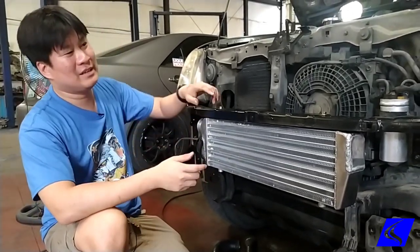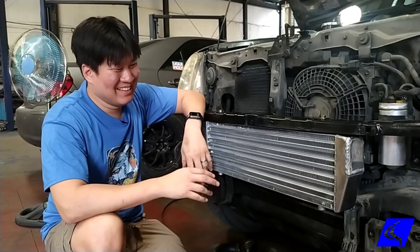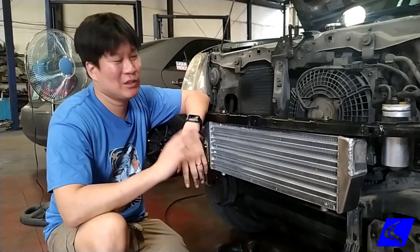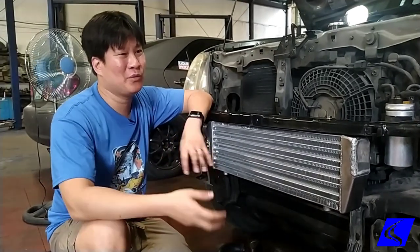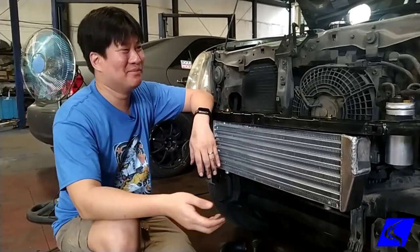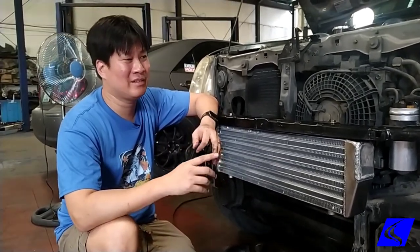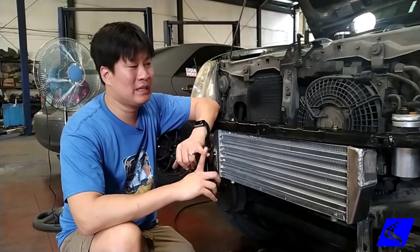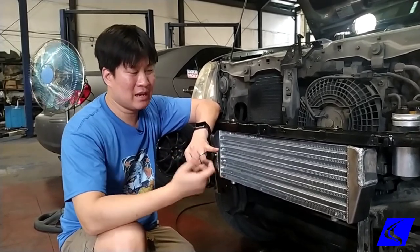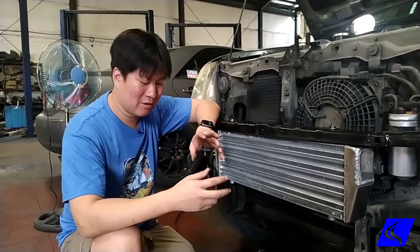As for the question of whether aluminum is better than stainless — which is hotter? Neither. The temperature inside the engine bay, let's say around 70 degrees — it's 70 degrees whether it's aluminum or stainless. So one is not better than the other when it comes to heat conductivity. It's just that everybody in the world is using aluminum. Plus, aluminum is easier to paint in any color — it can be powder-coated, spray-painted, or wrinkle-coated. While stainless — if you paint stainless steel, you can actually easily scratch it off once it dries. It peels off faster compared to when you paint aluminum.